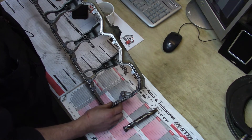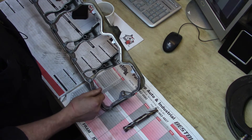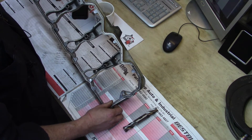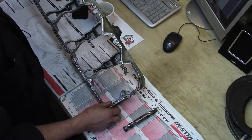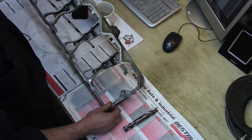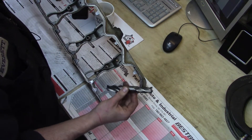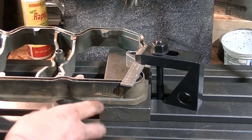By the pictures in the instructions, they don't really give a template or specific dimensions. But judging by the pictures, it looks like you'd use about a 7/8 or a 1 inch end mill to cut most of the way out to that edge. I don't have a 7/8 or a 1 inch, not yet anyway, but I do have a 3/4 inch.